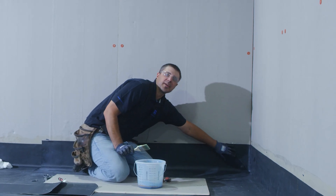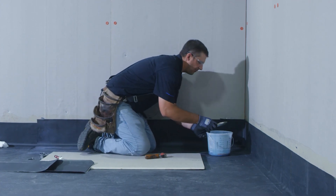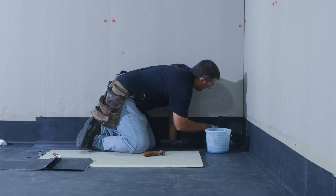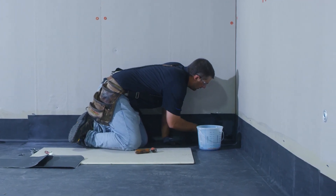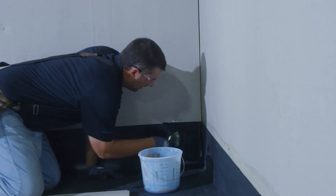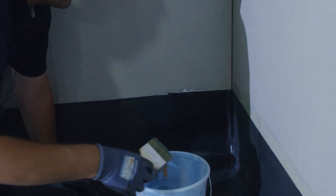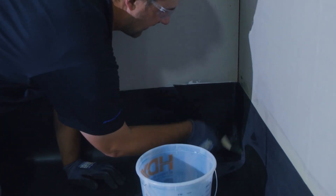After our pig's ear has been applied to the other piece of flashing, what we'll do next is apply primer for the piece that goes over the top to hold it down. When applying primer, it's always critical that our primer extends well beyond the piece we are applying to, to make sure that we get full contact and adhesion.